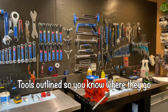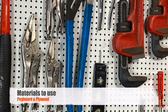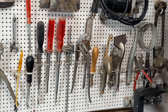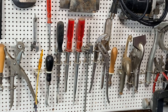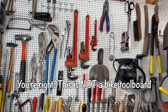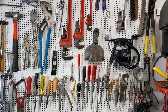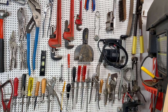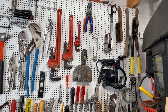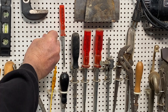The most popular material for tool boards is probably pegboard. The evenly spaced holes make it easy to hang tools — you just need to buy the right pegboard hooks and holders. The advantage of pegboard is that it's easy to rearrange tools since hangers can be moved to different holes. The disadvantage is that holders must be placed according to the fixed hole spacing, so you can't group tools as closely as you might wish, and some holders may fit loosely and fall out when you remove tools.